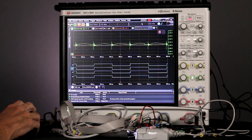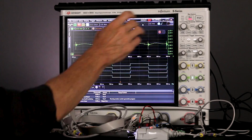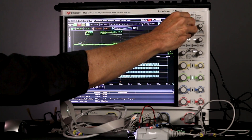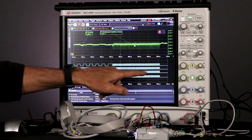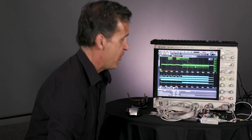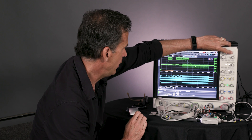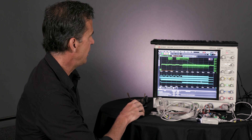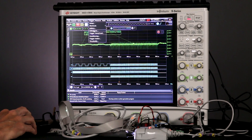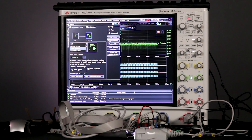I'm turning off a couple of channels and the math function. Now we've got this thing running again, and some of you with a good eye might have noticed that every now and then it seems like it glitches — right, I saw one. That's not my software. I've got this thing programmed to do the exact same thing: count up and then switch simultaneously, lather, rinse, repeat. So what's the glitch? That in fact is dropped bits due to power integrity. Those can be kind of hard to trigger on. In this case I've made use of our InfiniScan, which is under our trigger menu. When I pull up InfiniScan, there are rectangular regions I can create where I tell the scope to use those as trigger conditions — trigger if the signal goes through a zone or doesn't go through it. I've pre-populated a couple of these already, and I've said if it doesn't intersect those zones, then trigger on that.